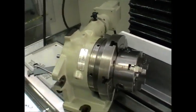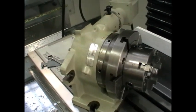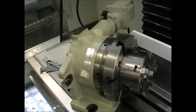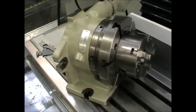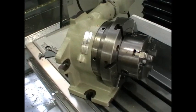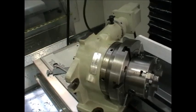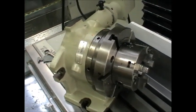Just quickly, while I'm on the super spacer — if you're considering one, I actually completely dismantled it down to every last little part and washed it all out in kerosene and inspected it carefully. The components are quite accurately made and the design is good — it's a copy of an American-designed 4th axis or rotary dividing head. However, the assembly quality was poor; there was dirt, swarf and chips inside it. I needed to wash it all out in kerosene, lube it, and carefully reassemble and adjust it. I'm really glad I did, because it wouldn't have lasted too long otherwise. That's unfortunately a fact of life with low-cost product.